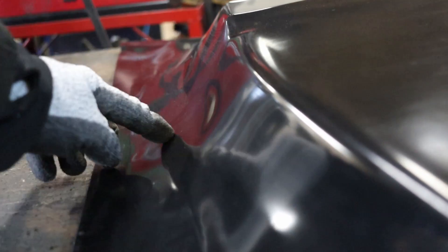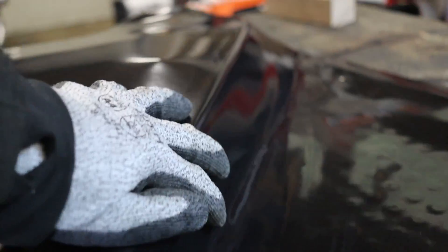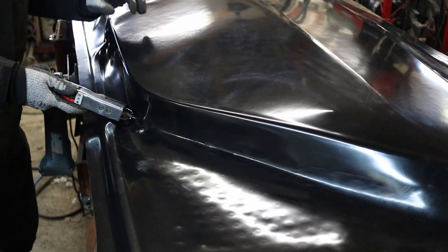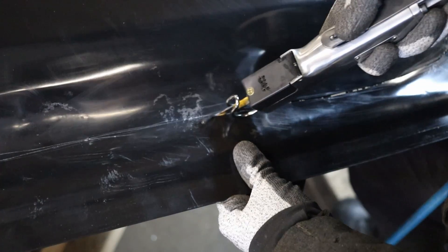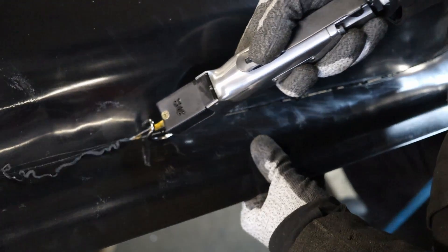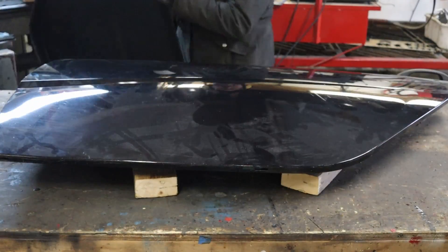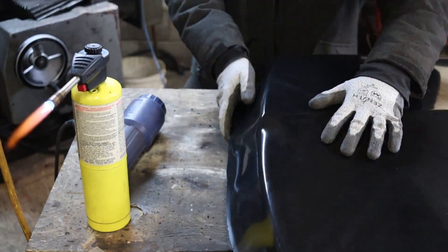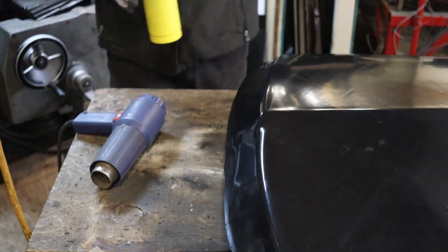Just before cutting the panel, let me explain my plan. I think the edges are not sharp enough — there's a big swoop in it. That's the end result of a too-cold plastic pull. So I will cut around these edges, leaving about two inches of material, then try to heat it up again and shape it into a more 90-degree sidewall. The lightweight approach doesn't seem to work, so let's bring the big guns.